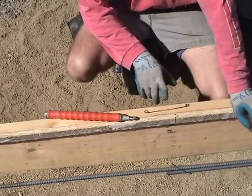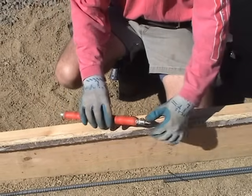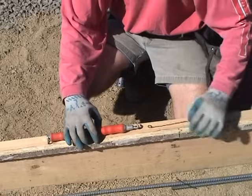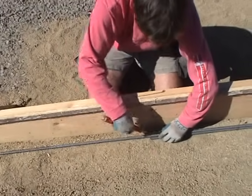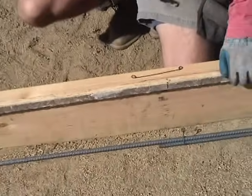Attaching the loose ends of the rebar together, they make a wire with knotted ends and a puller. This puller swivels out as it pulls and twists the wires together. So you take the wire, bend it underneath the rebar, place your hooks and pull, and you're attached.